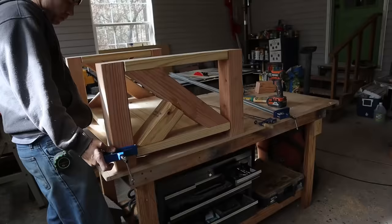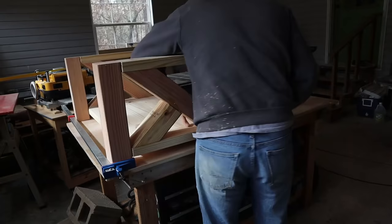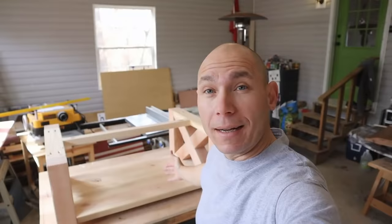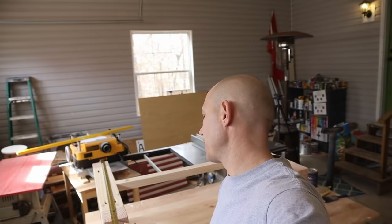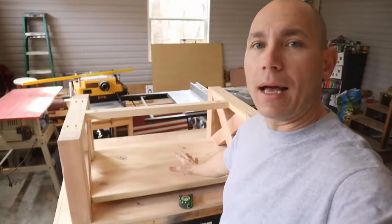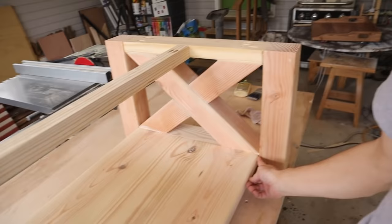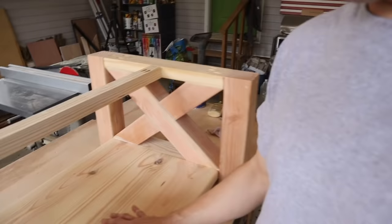Just using some clamps to hold everything nice and tight. I get the fit I want on the top side — everything's moving pretty hard on me. What you see me doing here is cutting a two by two, using it on the top, right in the center, pocket hole each end. I got that base complete. I barely had enough four by four material left over from a project several months ago to build that base. You'll need two eight-foot four by fours. Mine is 16 and a half inches tall by 26 and a half inches wide.